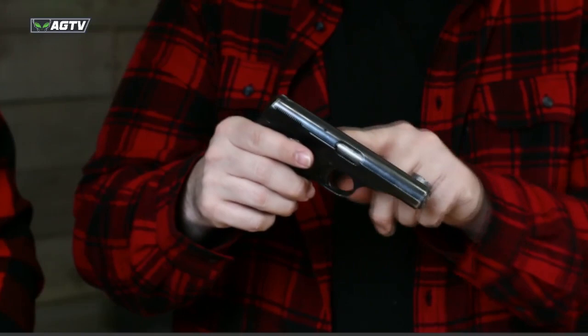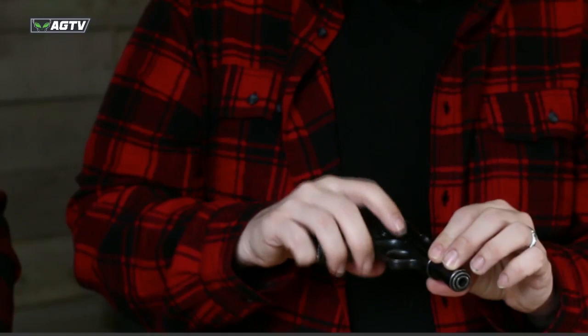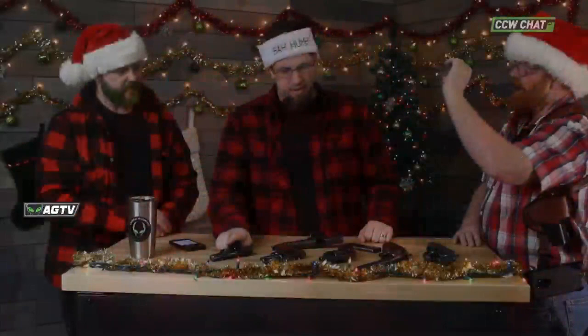No, that's not the case on this one. In this one, it's kind of a pain. You take the mainspring out first, and then the barrel actually has a key. You have to pull it, turn it, pull it. Inside there are three locking mechanisms that lock it into place. It's amazing. But it does kick up just like other semi-auto barrels. That's a difference. I didn't know that about the Model 1910, but that is true about the PPK and a number of other guns: the barrel is fixed to the frame and doesn't move at all. Everything else does.